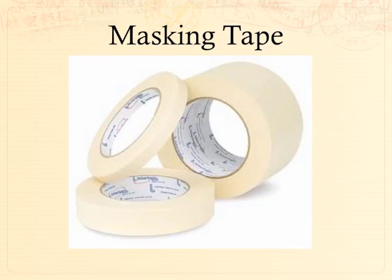Masking tape is used in the paint industry. It's a paper type of tape not meant to take paint — it's actually meant to repel paint or keep it from seeping under. Masking is taping over an area so you don't get paint on a surface you don't want it on. It commonly comes in a manila creamy color, which is the inexpensive type. Blue painter's tape is a masking tape with an extra plastic additive, and the green frog tape has a really awesome paint-repelling compound that works better than any tape.